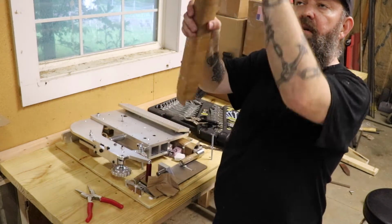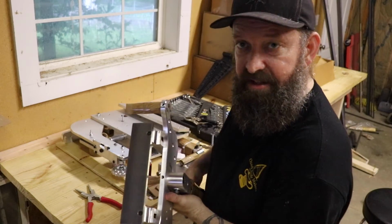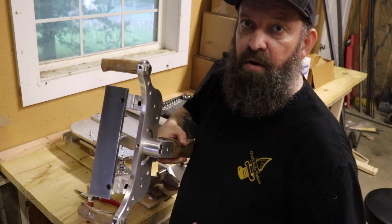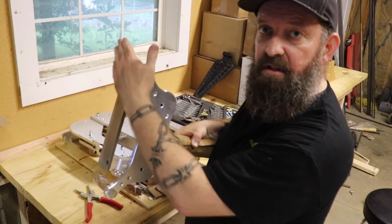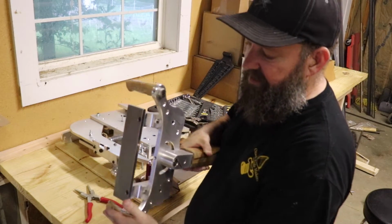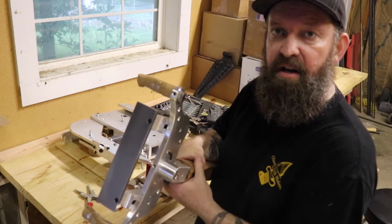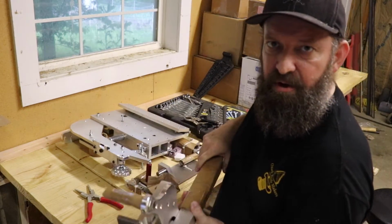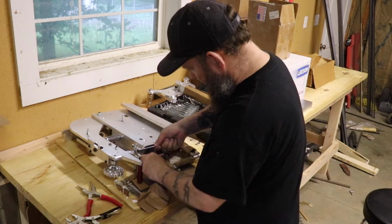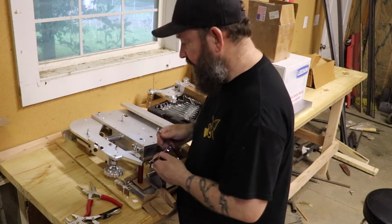All right, in case you were wondering earlier what the heck a platen is, this is a platen. So basically your grinding belt runs along the face of this platen and gives you a nice flat surface, so whatever you're trying to grind comes out nice and flat. So that's a platen, and you'll see how it works when I get it all together. Oh, endless bolts.